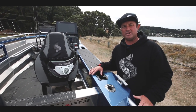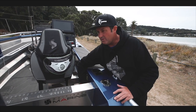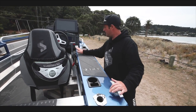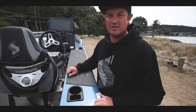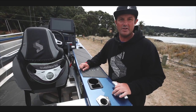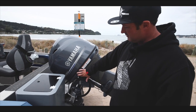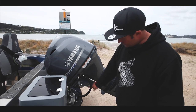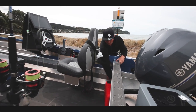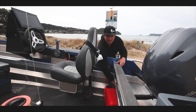Think about your boat and your engine and what state your engine is in. Are your electrics on, are you ready to go? Make sure that your electrics are on, make sure your boat's in neutral, make sure everything is ready to go so when you need to turn the key you're not scrambling around with a swell coming, still trying to figure out why your boat isn't turning on. A simple and effective way to check — use your tilt and double check your tilt bracket to make sure your tilt still isn't down. Check your fuel, make sure you've got enough and that your bulb's primed up and the vents are open.